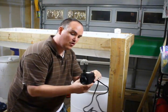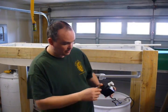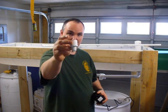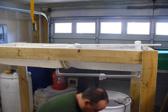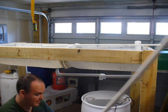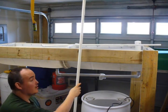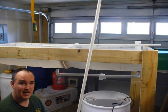Next we're going to go ahead and put our 400-gallon-per-hour pump inside our fish tank. To connect your pump to your PVC, you're going to take a one-half male by three-quarter PVC adapter and it's going to screw right in there — fingertip tight. Then you can run your PVC right into your pump straight up so that it provides your water up top. Very quick, simple, and easy. You don't need all kinds of crazy connectors to do it.